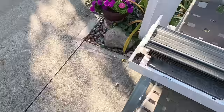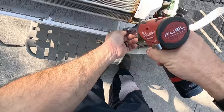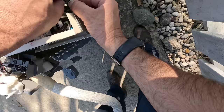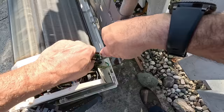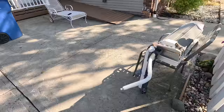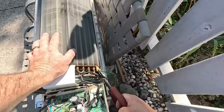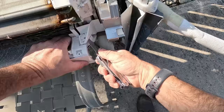Usually got some screws down here — I've already taken these two out, so it's ready to pop out. Now, you've got to pull these thermistors out gently so you don't ruin them. Probably going to need that clip that goes with it. Let's go ahead and mark this one here 'top.' If you get this in the wrong spots, it knows. Now, let's insulate the ground cable — like as if it's going to short into something when it's already grounded. I mean, come on.